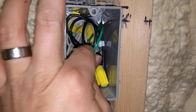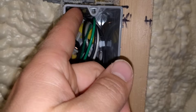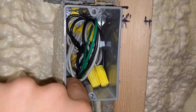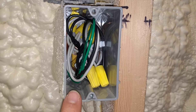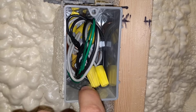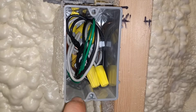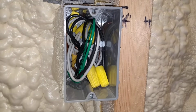You can see now that it's rolled in here that there are no wires pushing up against the edge of this box — it's probably in from the front about a quarter of an inch. That's important because when they come with a rotozip to cut the drywall out, they'll put drywall over this, pop a hole through, find the edge of the box, and cut the hole around the outside edge. If your wires are way out or tight against the edges, they could be damaged from that.